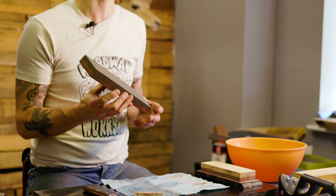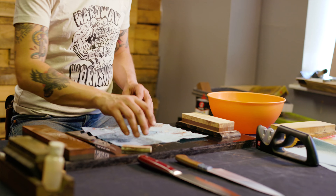Those are a few tips on sharpening. Obviously you're going to have to find what works best for you. I'd encourage you to start simple - go get something that's not too expensive and start with practice knives, and just have fun with it. Please don't get discouraged if your first attempts dull the knife more than when you started. Remember the Sharpie technique. If you find ceramic rods or diamond rods, there are all kinds of different things, but the good old-fashioned bench stone and learning the technique to use it is going to carry you the farthest, keeping your knives sharp for those situations where you need them. Please visit joinerdyeknives.com - we've got a lot of information on the blog as well as items like our snake oil that can help condition your knife.